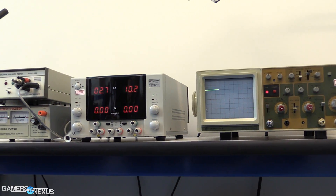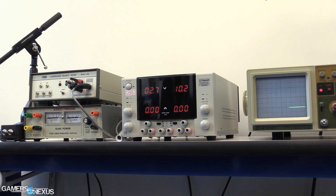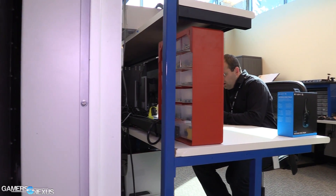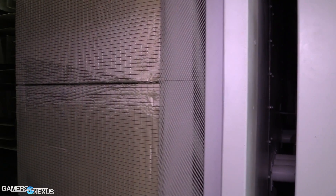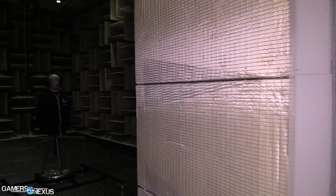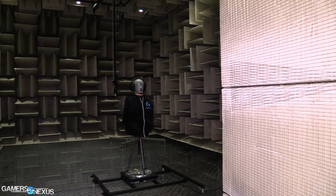So we build an anechoic chamber which is isolated from the outside world. It has its own foundation separate from the building. It's got a spring bed on the ground to isolate it from vibration. And then inside of the room, the entire room is covered with four-foot-deep foam wedges. What those do is absorb sound. So if I speak in that room, my voice goes out and gets absorbed into the wall and doesn't bounce back. That's a bit why you can feel a little weird in there, because you're used to having echo around you.